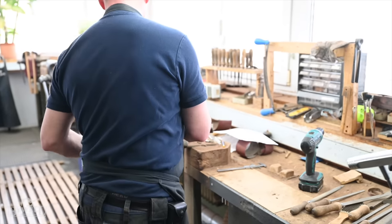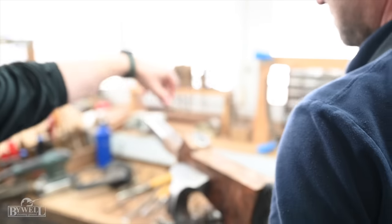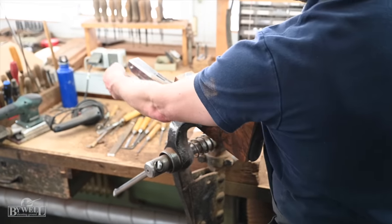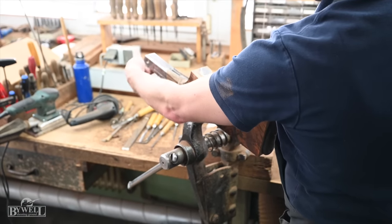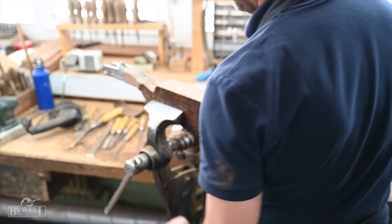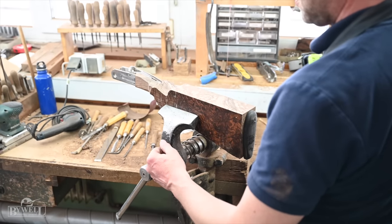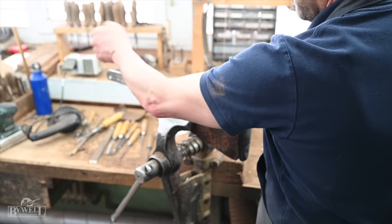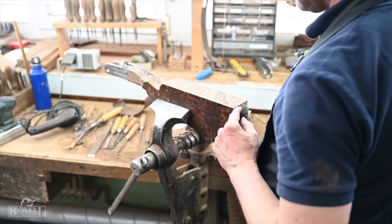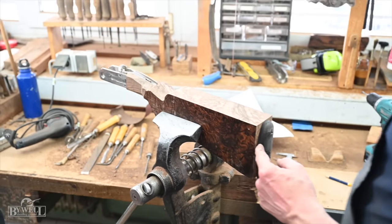So I see you have the cast line now. How do you draw that? How do you actually get that? That was done over the rib. From the rib, all the dimensions, drop and cast, were done over the height of the rib and over the center of the rib, and then the stock has an offset of about 8 to 9 millimeters.